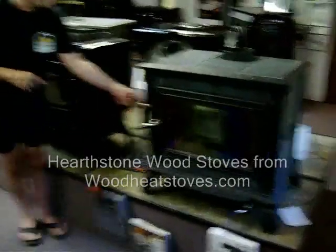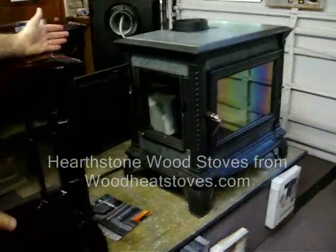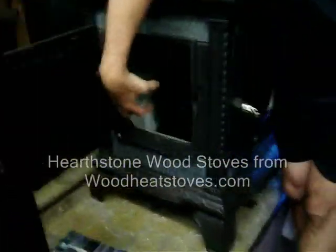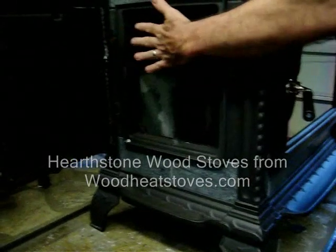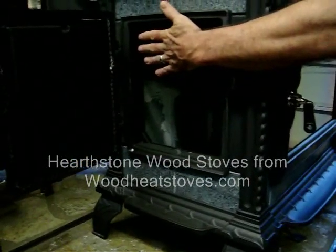Another great feature that makes this stove attractive is a side loading door. A side loading door is often overlooked and rarely available as a convenience feature, but here, because you can push the log in from the end, your hand never goes into the firebox. You're pushing coals and ashes away from the door so they're less likely to fall out, and you're opening a smaller door than a front door would be, so the chances of smoke coming out are very much reduced.